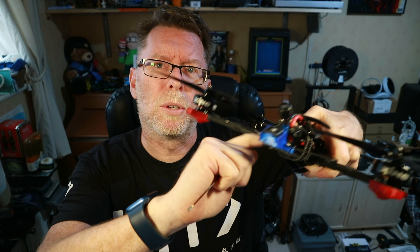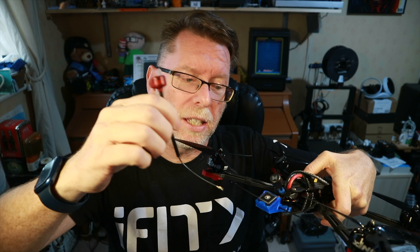With the extended antenna we've got a huge antenna that can go over the battery without a problem. This isn't something I can quickly change at the field, because it involves getting into the Walksnail, taking the VTX slightly apart to fit the new UFL antenna, then fitting an adapter. UFL to SMA adapters aren't that common — you can get them on eBay or a few FPV stores, but MMCX to SMA is much more widely available. I really hate UFL connectors — they're very fragile and not designed to be repeatedly disconnected, so I plan to fit the adapter once and then easily swap SMA antennas after that.